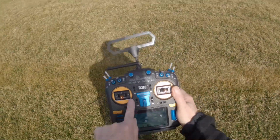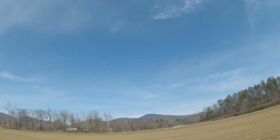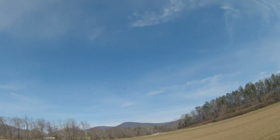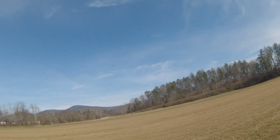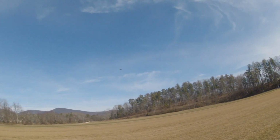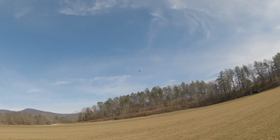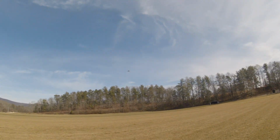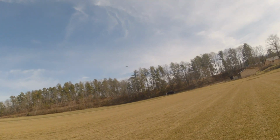And as you can see, I'm still being very careful to keep my throttle at 50%, because if I come out of this mode into stabilized, you better be prepared for it to drop or shoot up. And having your throttle at 50% is the best way to hopefully just have the platform go in from altitude hold to stabilized and stay pretty much in that position.